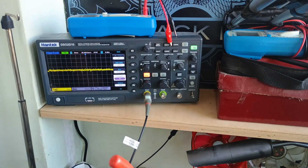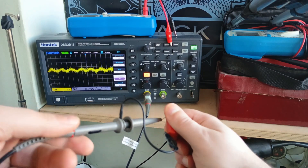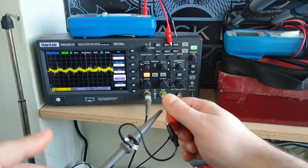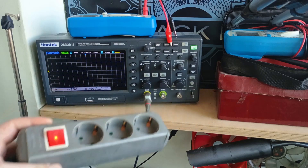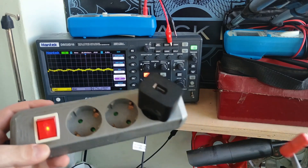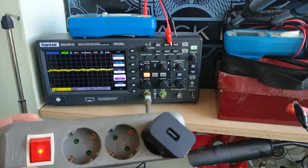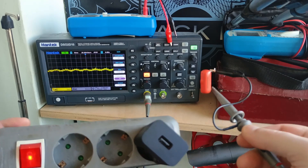The range on the scope is very sensitive, so even if I hold the capacitor with my hand you can see the interference. But an even better way would be to take a power strip and a phone charger, and instead of my fingers I'm going to use the magnetic field around the charger to determine which side has the outer foil connection.